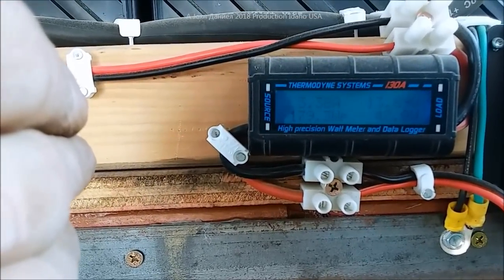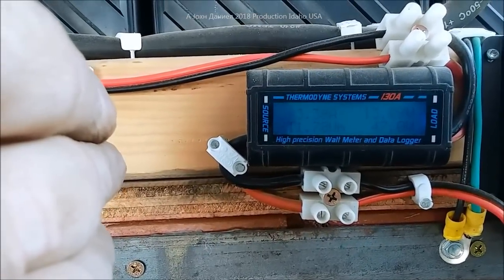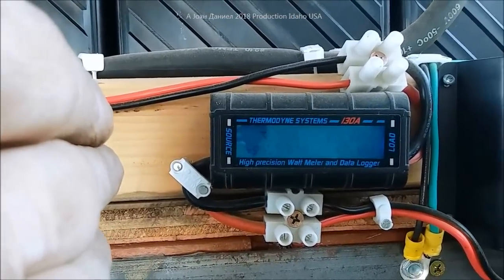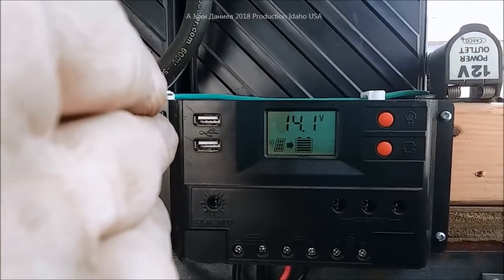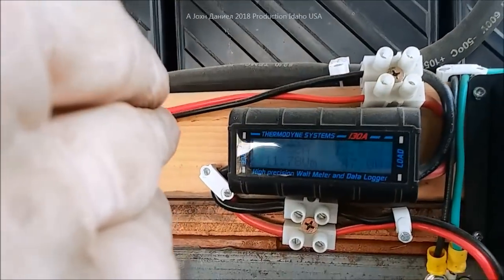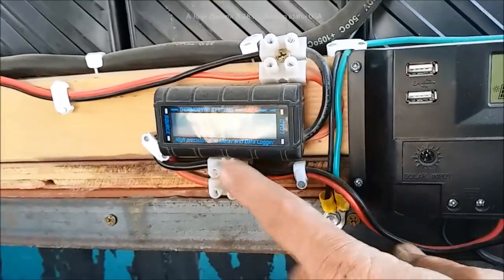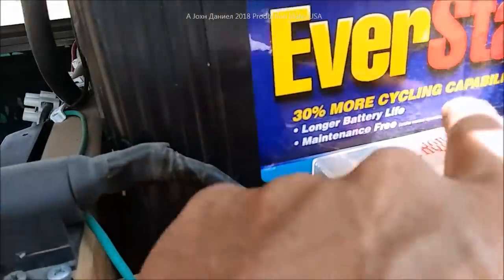Three point three eight amps. It has had a 179 watt peak. The amorphous panels will out-peak - they will do a way higher peak than what they're rated at. It's currently 47 watts coming in. If you look over here you'll see the watt hours, what they're rating at and what they've been doing - it gives you a little data recorder. Anybody interested in these, I'll put a link at the bottom of my video, as well as for other stuff like fuse blocks and other items.